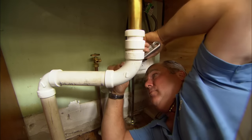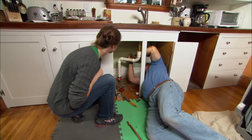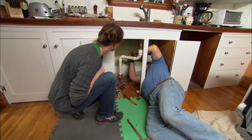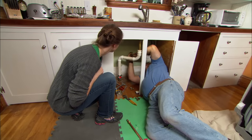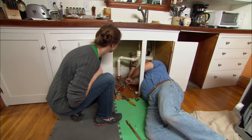I'm going to make the connection with the old kitchen sink supply hose onto the new valve on one of the branches. Why do I need a valve there? Well, you really want to have shutoff valves under every single fixture for service. Someday, the faucet will need repair or the dishwasher.